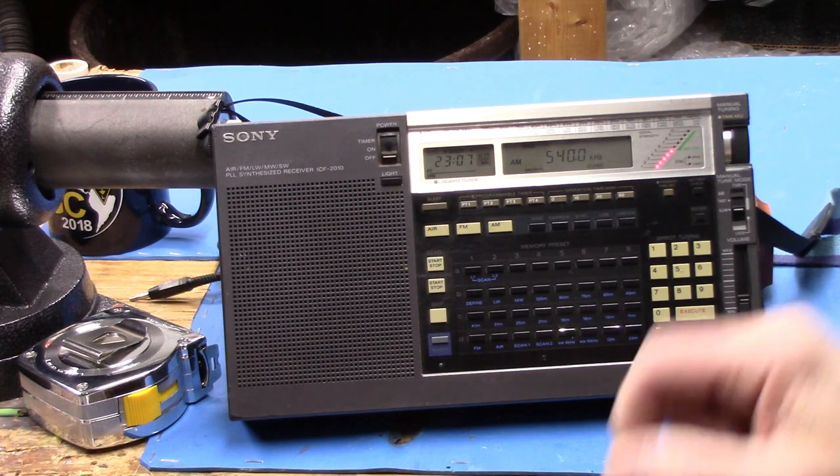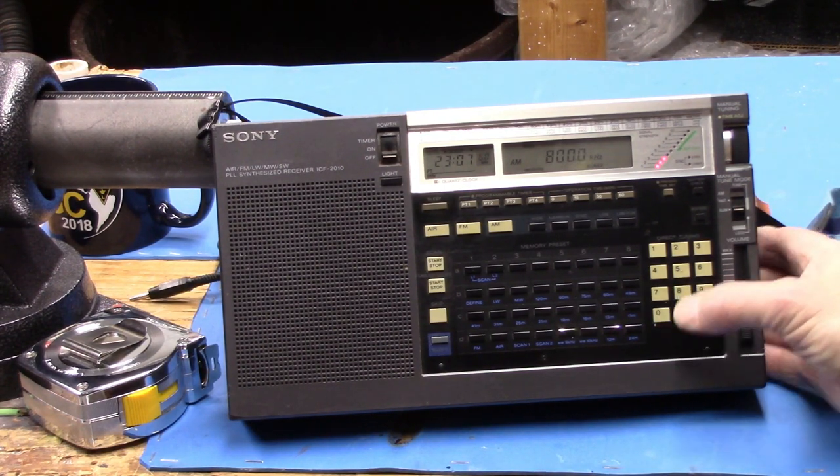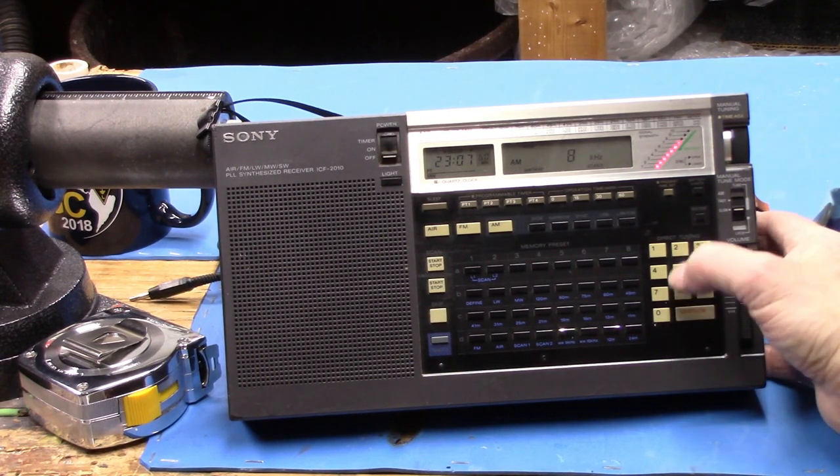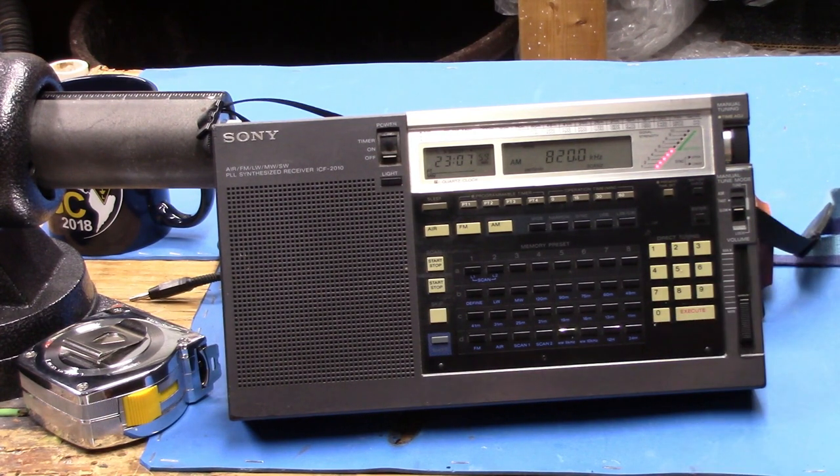All right, that's weird. 800 again. Okay, yeah, that's right about there. So 820, 820 maybe? Yeah. Okay, turn it down. So 22 turns gets us up to 830 kilohertz. I think we're going to start gaining a little bit more on the high end here as we start taking turns off. Let's go down to the bottom.